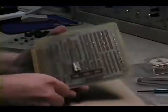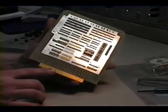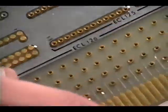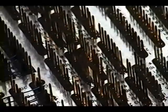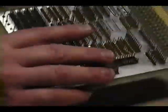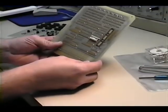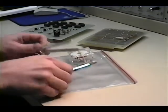In EE-455, you'll be using something similar to this. This is an example board intended to be plugged into a printed circuit socket. You can see the gold-plated edge connector fingers. On this board, there is an example of a variety of different types of what they call machine colleted wire wrap sockets. The machine colleted sockets are distinct because they're round, as opposed to having rectangular apertures for the ICs themselves. We're going to be talking about the types of tools and the methods for using these tools for wire wrapping.